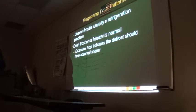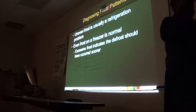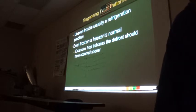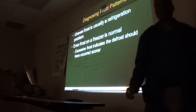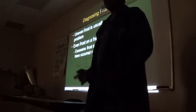You know what I do in cases like this? Stop leak? No, stop leak can't work. I tried it. The leak is too big. I just eliminate the condenser unit here, cut this out, and I bought a new unit and mounted it right next to the box inside. I put a condenser unit right next to that box, because the lines were the problem.